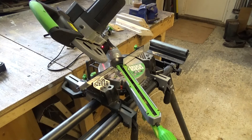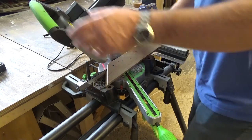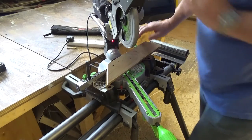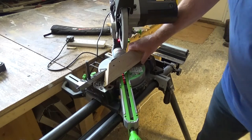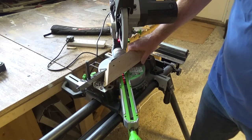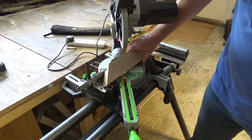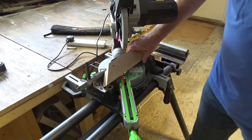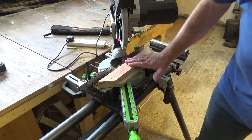So there are ways of finding out what you set your miter and bevel angle to, and there are other ways of achieving the same objective. You could actually set the wood up on the miter saw at 45 degrees and just cut a straight miter — if you set that up 45 degrees and cut your miter at 45 degrees, you'll achieve the objective. But it's very difficult to place the wood in the right position and it's also quite dangerous unless you've got it supported properly. I've done that in the past before I found out how to actually cut these on the flat, and you can do it, believe me, but it's not nice. So it's far better to actually cut it with the wood laid flat on the miter saw.